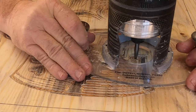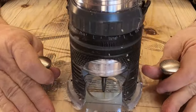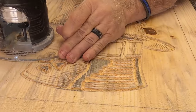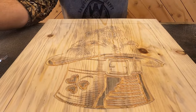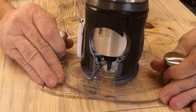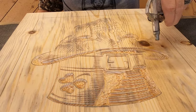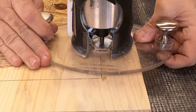Once he had all of his detail carving done with the carving liner and the shallow stuff with the profile bit, he dropped it down to a quarter of an inch and went in to give himself plenty of room and take out any areas he maybe missed carving shallow. Normally when we do our cleanup - which is going back in and removing all the excess wood after our profile work is done - we do it with our 90 degree bit, but dad's going to use the 60 degree to carve the lines in the frame. He did that at 3/16ths of an inch deep. The only thing you have to worry about is getting a little bit smaller circles for your texture because it doesn't have as wide a cut as the 90.